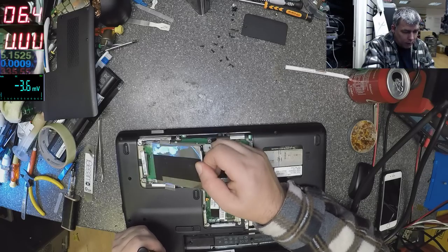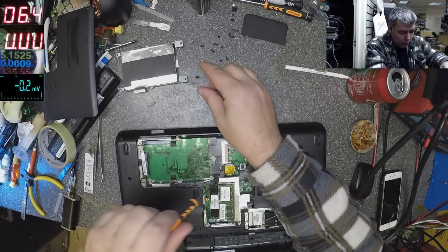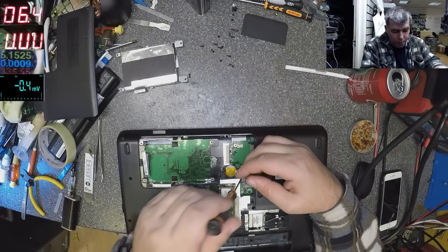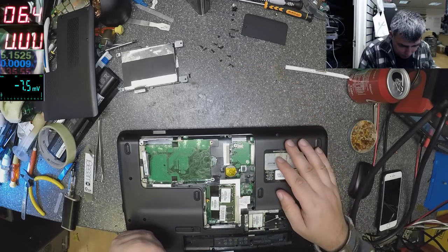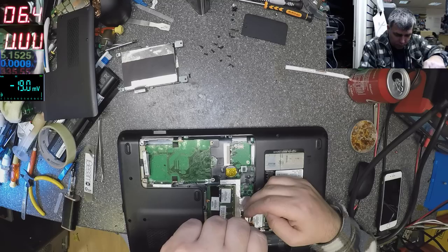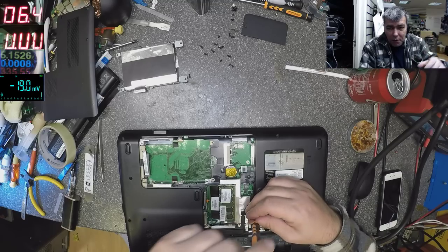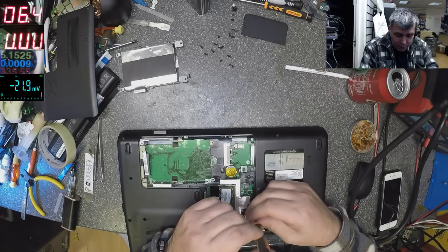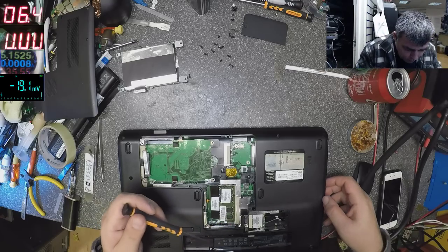So I have a message like, I have light, but when I press the power, it's not coming on. Yeah, that's the problem. Because that pin is not read by that microcontroller, which I call the startup chip. And actually that 3.3 is from a resistor which goes to 3.3 volts. So that's why there is voltage there, not because the chip is reading that power on pin. So don't get these things wrong.